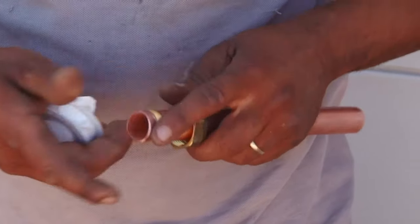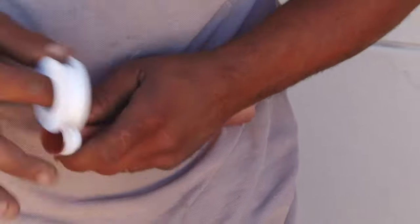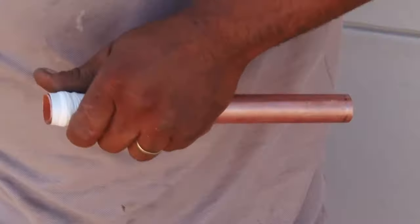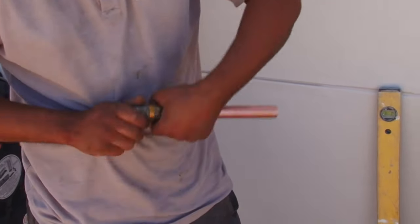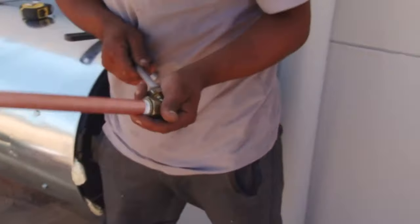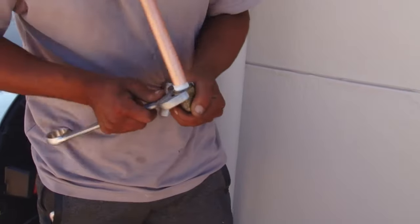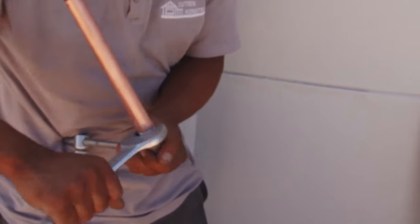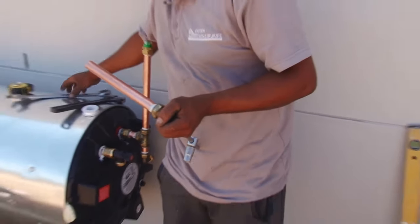A copper ring is slipped over the pipe, and plumber's tape is wound over this copper ring. The fitting slides onto the pipe up to the ring, and the bolt is secured to the threads of the fitting, with the tape-covered brass ring being squeezed into the joint to create the seal. This modern method of joining copper pipe does not require any soldering, reducing the time and hassle factor of plumbing quite a lot.